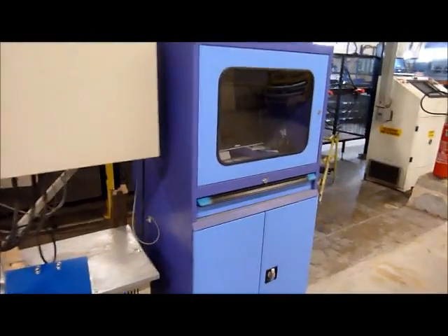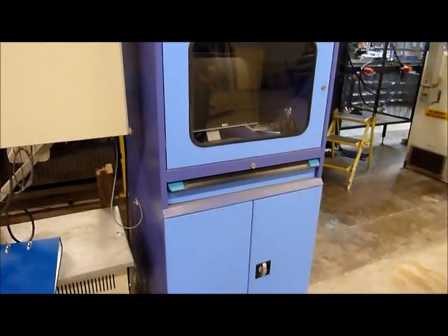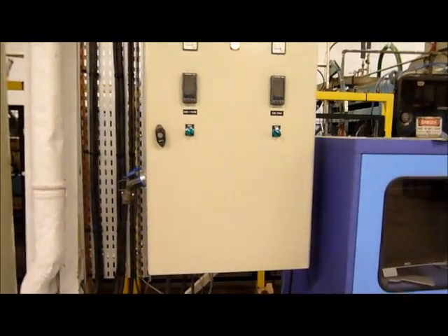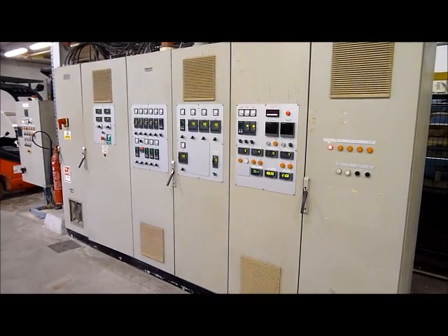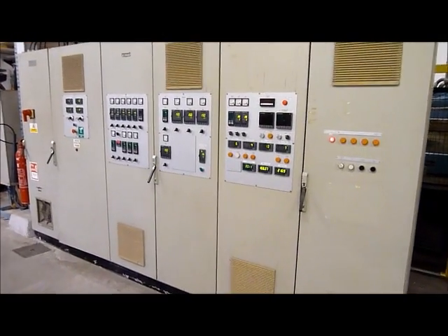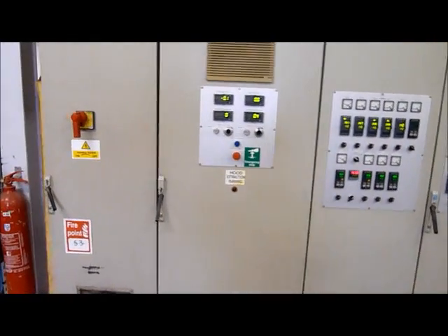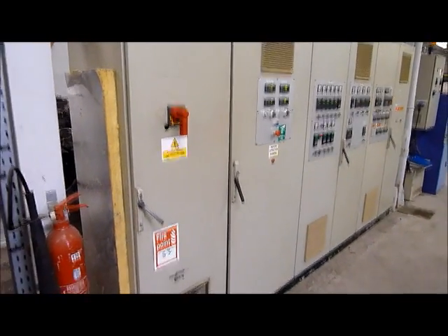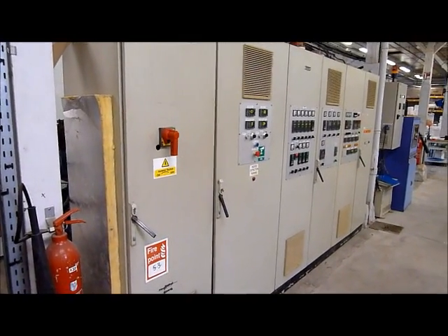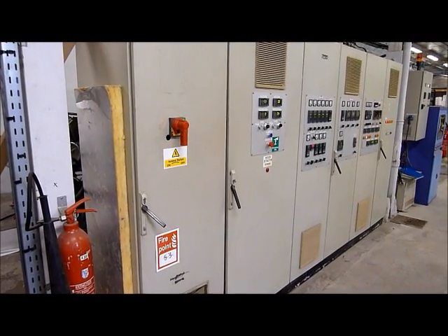This is the diagnostic panel which is not coming, and this is the die head panel for the temperatures — that is not going either. So the panel suite starts here. You have a six-bay panel. That is the standard set of control panels controlling the extruder, the screw speeds, the drives, the temperatures and the pressures.